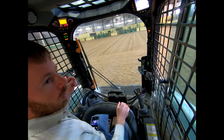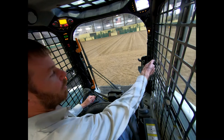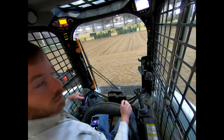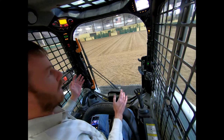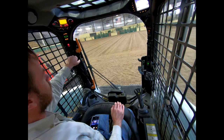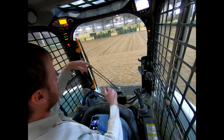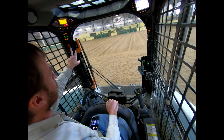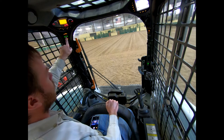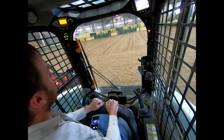The engine has started, but even if I push on any of these joysticks, nothing happens. Most of them are going to have a parking brake. On this one, when you pull this lap belt up it truly engages the parking brake, which keeps you from rolling, so make sure the parking brake is off. On Bobcats, there's a button that says 'push to operate' — when you push this green button, you'll hear a click, and the light comes on.